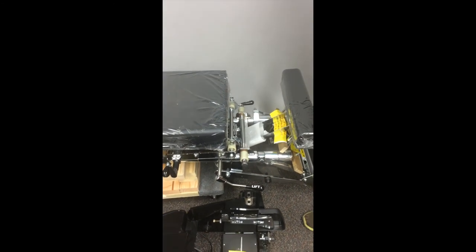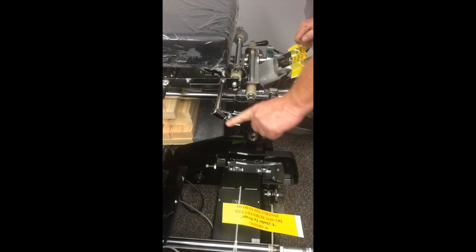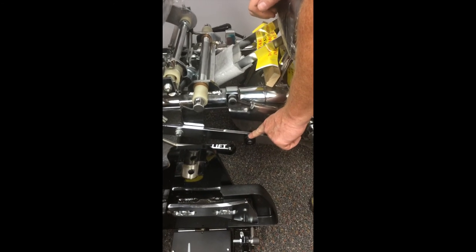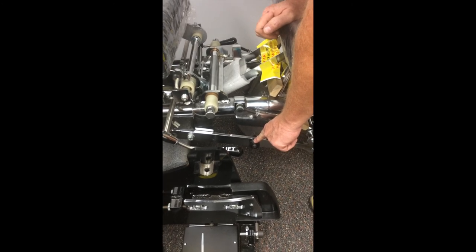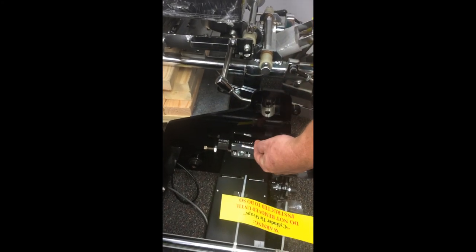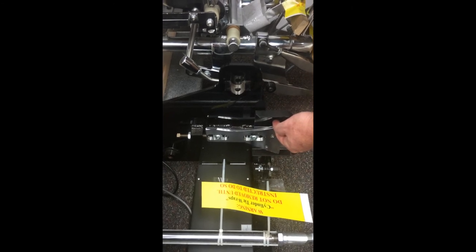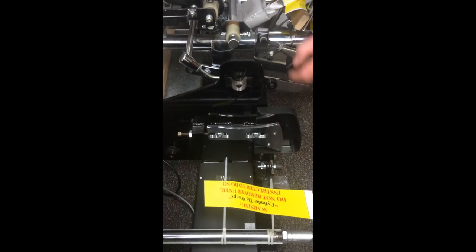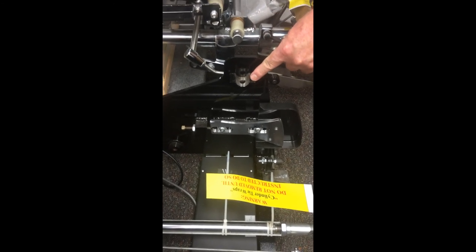They just slide in. The next step will be to orient so that the shaft will go into the shaft carrier, but there is a roller on either side of the lower section of the table, one on the left side, one on the right side. And the action to remate the table will be to take that roller and bring the roller into that opening there. Once it's in that opening, the pivot shaft will be just above the pivot shaft carrier and we'll lower that into place.